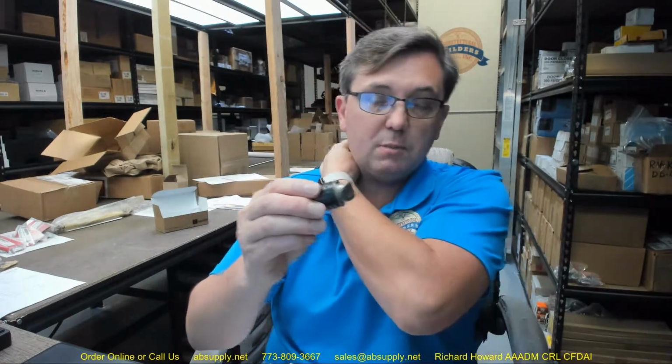Wood doors, obviously. There's no mortising to be done, no screws to hold the faceplate on, and it is really used as a means by which to make life less work for the person prepping the door for the lock. That's just the bottom line. I would say there's no other redeeming value to a drive-in latch other than less work.